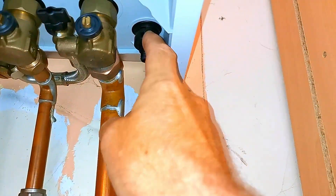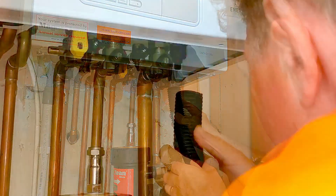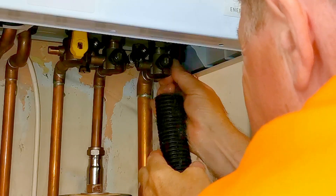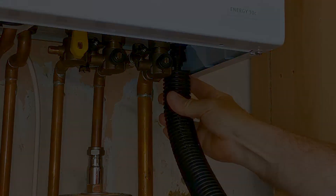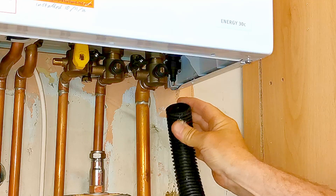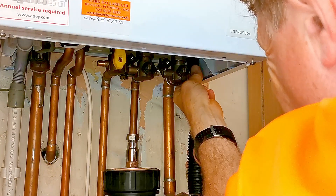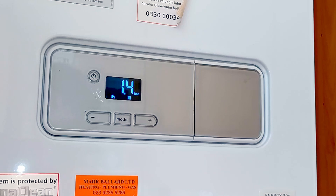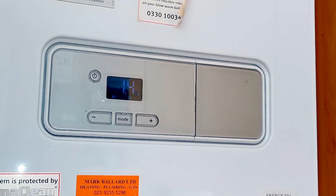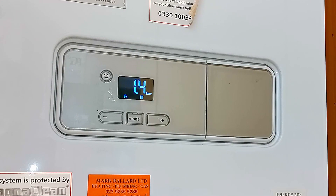I'm going to go underneath the boiler and open this valve to let all the water out and drop the pressure right down to zero. I've got my water vacuum underneath to catch it — opening the valve now — and there we go, all the water is coming out of the boiler. There will still be some water in the boiler but it will be under zero pressure, so our gauge should read zero. I'm closing that valve now. You can see the pressure has dropped a bit down to 1.4, but it should be reading zero, warning us there's no water — but it's not doing that. It's showing 1.4 bar, which is completely incorrect.